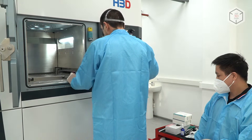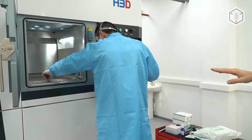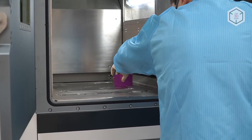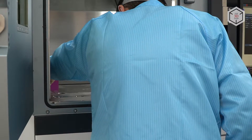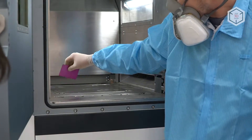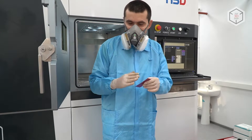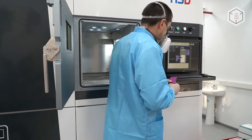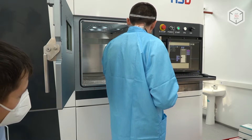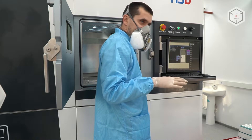using a paper or plastic card as our guide, we are checking that on each side of the build plate the platform is level relative to the rest of the build chamber. The procedure is that we are placing the card in between the build plate and the build chamber and making sure that there is no light in between those gaps. After having checked with the card that there is no light on each side, we can set this point as zero on the Z axis.